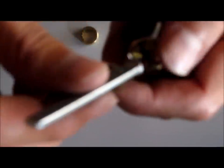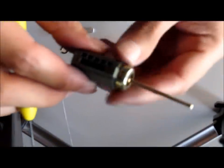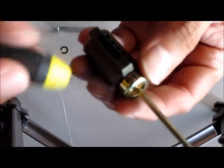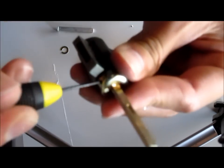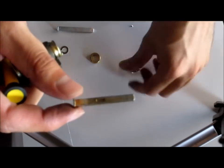Along with the cap comes this piece too. From the previous deadbolt you need this piece right here so you can replace this piece that fell out. You're going to have to pull it off — on the tabs there are going to be some little tabs in there. You're going to need a small flat screwdriver and you'll have to pull the tabs out so you can take it off. This is the piece that you need.